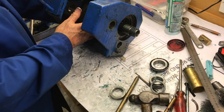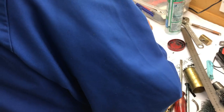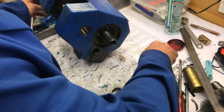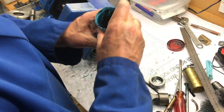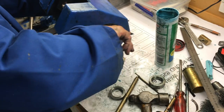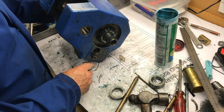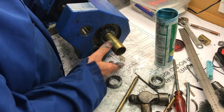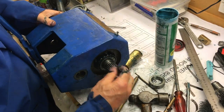We don't have to put that spacer in, thank goodness. Instead we put the small spacer in here on the outside and push it in against that key wheel on the inside. Then we put on the wheel bearing race with its usual dollops of grease — if I can find any. It's a tight fit on there, so that's where this comes in. Let's put it up on the end, which is usually easier.